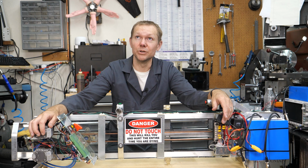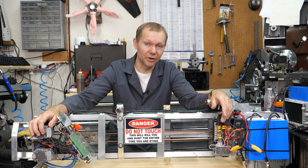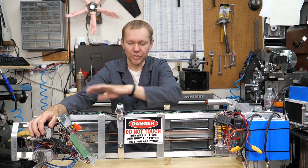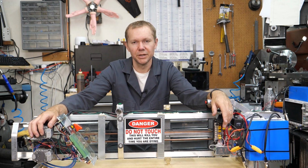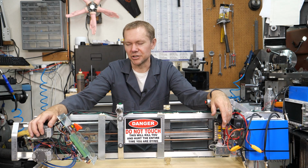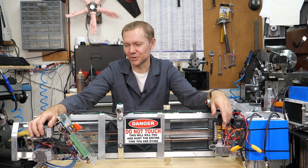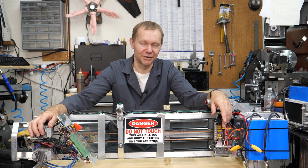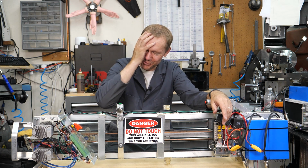We initially used the Adafruit level shifter, and it was working great for all the testing. Then when we tried to bolt this thing down and make it mobile, I said, hey, I'll use these more compact ones from Amazon that were Texas Instruments or whatever they were. I should have listened to the reviews. People said these are not worth it. Some people got them to work, but most people were having problems with them. We ended up switching back over to the Adafruit, and it made a big difference. But I burned so many days trying to troubleshoot what wasn't going right.